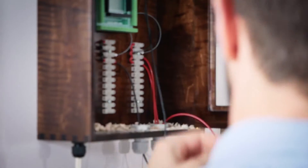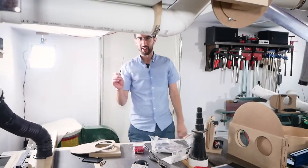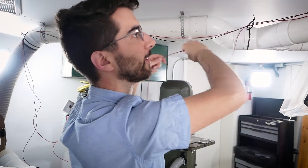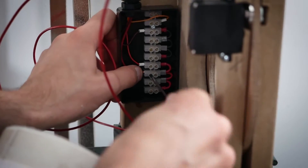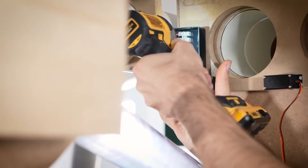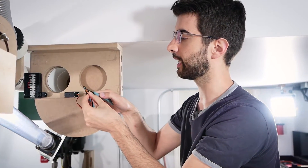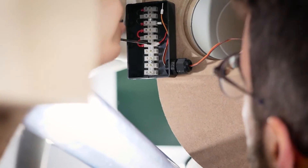Snippy snippies, strippy strippy, crimpy crimpy, screwy screwy. Now I've got to wire more power to everywhere in the shop, basically. I don't have a more elegant solution than just a bunch of zip ties for now — I'll get some sort of wire wrap going on maybe eventually. Probably not. Each blast gate gets its own terminal strip in a box so I can make a bunch of wiring connections. The servo motors have this little dinky connector — it's useless for my needs. These are called ferrules; they make a more secure connection on a terminal strip with stranded wire.